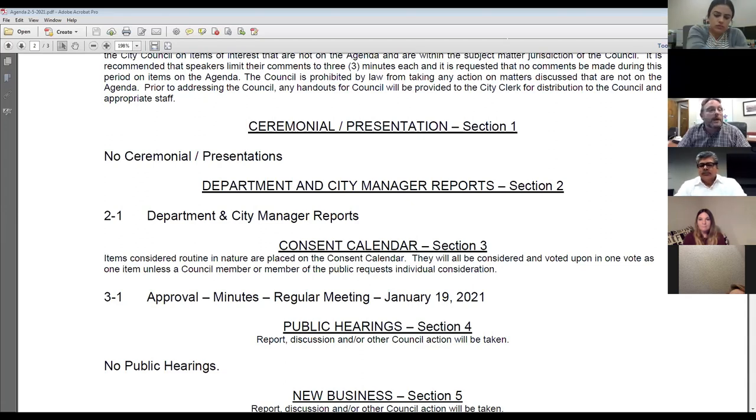Thanks, Frank. The only thing I would add is that when well 10 went down for regular maintenance, the issues around that well were all around subsidence. It started crushing casings and it was very difficult to remove the columns and get everything back together. So it took significant effort to get that well back up, and a lot of reinforcement to help with future subsidence. So thanks, Frank. You're welcome.